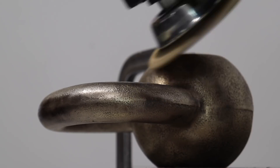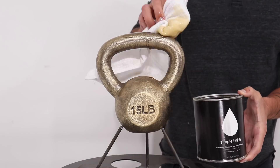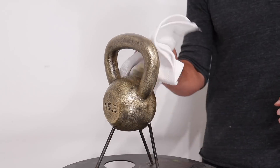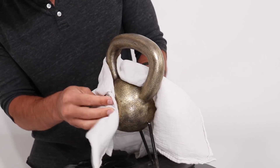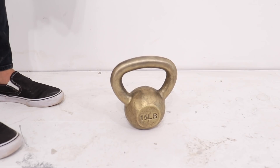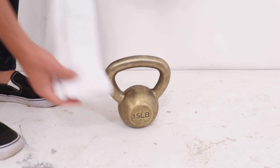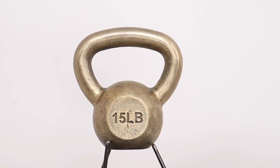I didn't want it to feel like you had your hand on epoxy, but at the same time I don't want the kettlebells to have a dirty finish that comes off onto your hand or clothes. So I sealed the freshly brass-plated kettlebell with some Simple Finish by Maker Brand. Even though this is typically meant for wood, this boiled linseed and wax finish is fantastic on steel. I rubbed on a thick coat — really easy since the kettlebell was still a little bit warm — then let it sit for 10 minutes and rubbed out the excess with a clean rag. I tested it out using a clean rag, rubbed it vigorously against the brass handle, and the rag was perfectly clean. This is important because I don't just want this to be a decorative finish — I want it to be a real material finish that will protect the cast iron from rust, because brass is a non-ferrous metal.